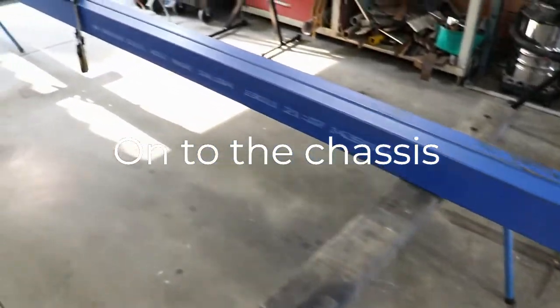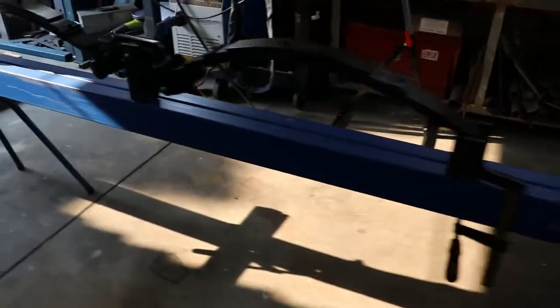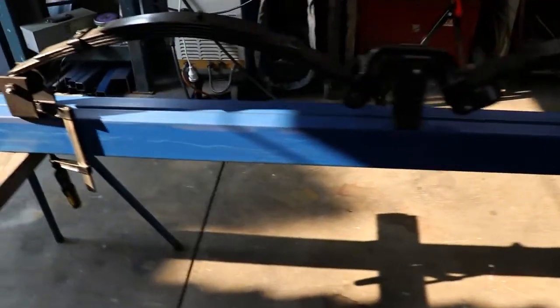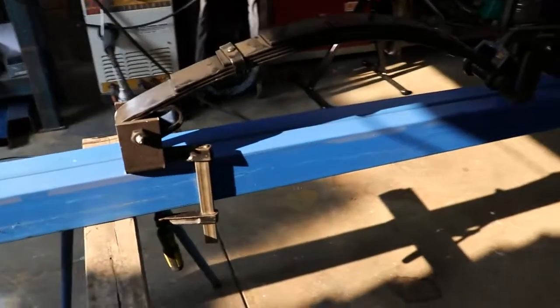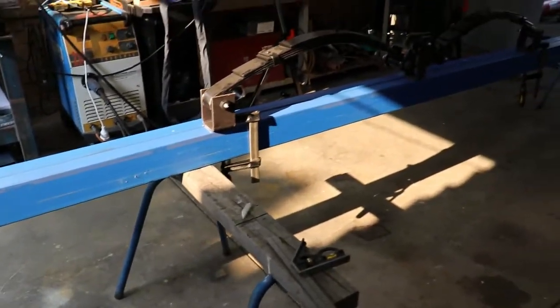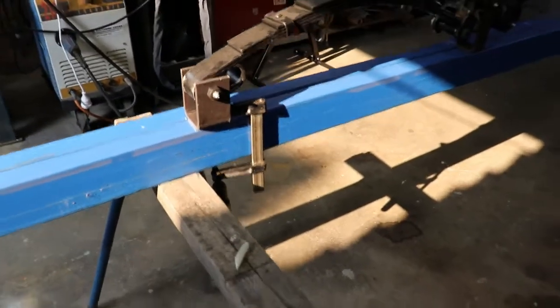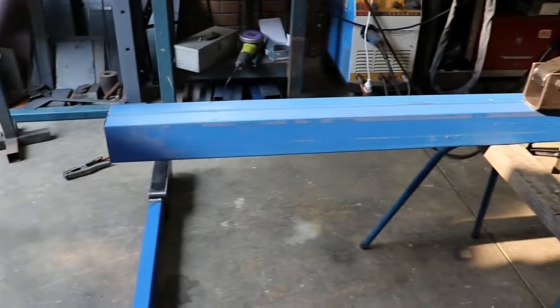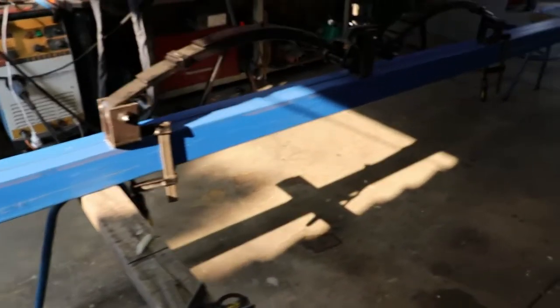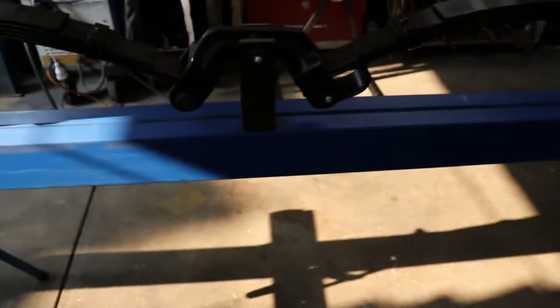I've just done the spring layout for the trailer. So there's the spring set in position, and I'm going to beaver tail the trailer, so I need to know where the rear shackle mount is, which is this one here, and so from there back will be a cut, and that's where the springs will go and so on.